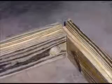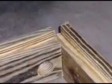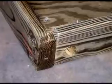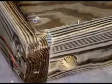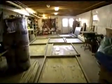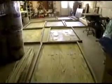For building the boxes, I cut a rabbet in the back of each pressure-treated 2x4, then drilled holes where the headers will exit the sides of the panels. I assembled the boxes with screws, including the plywood back, which fits into a rabbet in the back of the 2x4s. What is missing from this video is that each box has 3 2x2s running across the back of the panel. This supports the copper core solar panel and strengthens the plywood back.